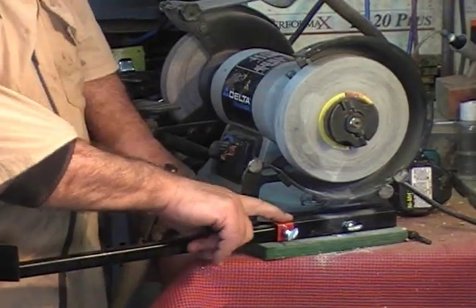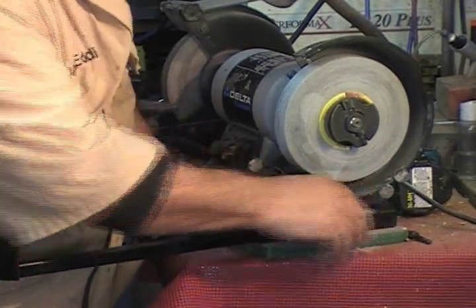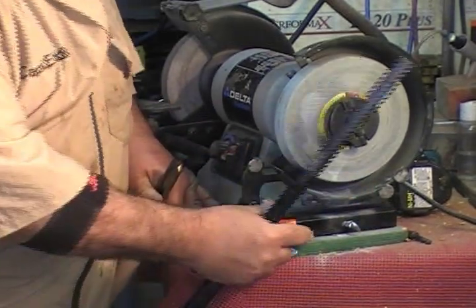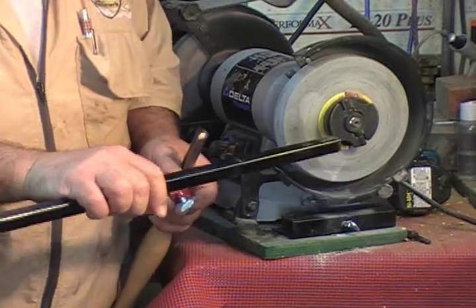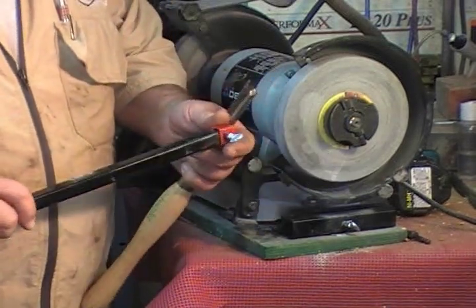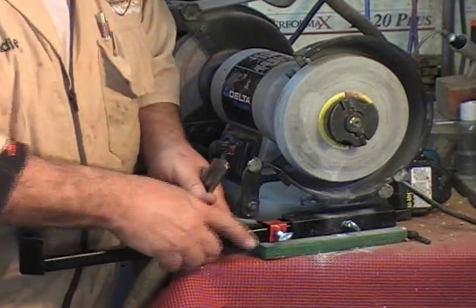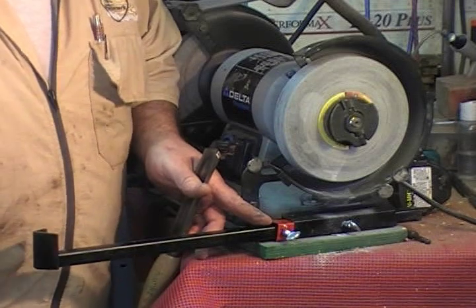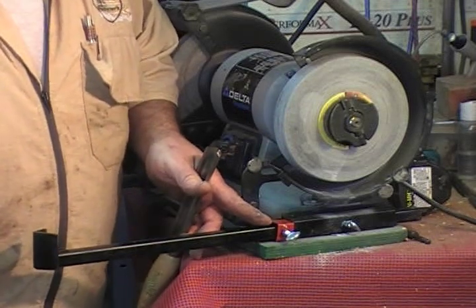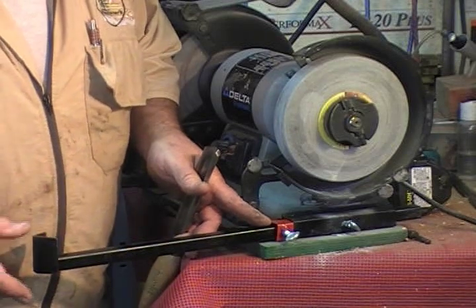The base is set in its place. What we'd like to do right now, because you have the parts, is I'm going to show you how to use the gouge rig and AccuSet. An AccuSet is an important part of the project because it helps you not remove so much steel each time you sharpen, by resetting your gauge right where you had it the last time.